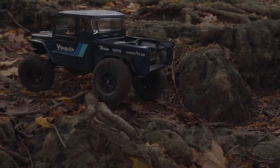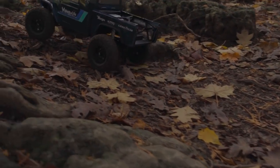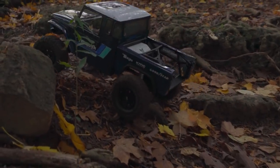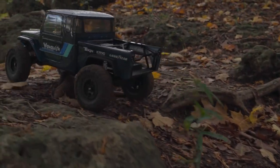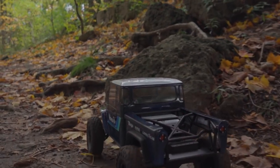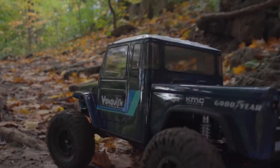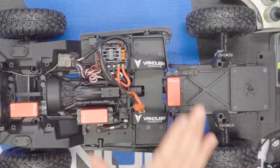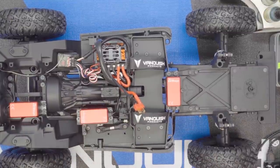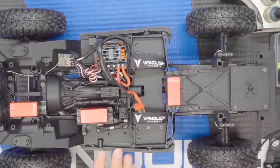And I think my main complaint with trucks in the past that used all of these servos was that they were micro servos or mini servos. They were of a dubious quality for sure. And any actuation that they were doing was done through cables, which can loosen and spread over time. And you're not going to get that same kind of reliability that you would from a system like this, where we're using full-size servos and links attached to rigid mount points. So this, while being more complex, and I do admit that, I think you're going to see a lot less failure rate here because you are the one choosing the electronics.